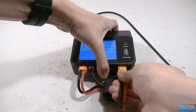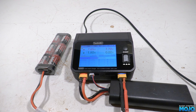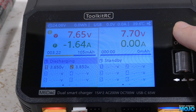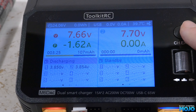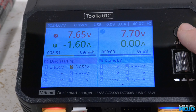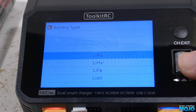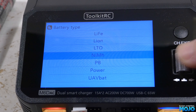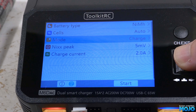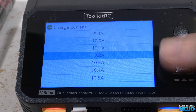While that lipo is running, I'm going to connect up an adapter lead to the second port and top up a six-cell NiMH. It doesn't use the balance port so we just need the main connector. A short press switches the charger channel — it could be clearer on screen; you just get a little one or two in the corner. It would be nice if it was more bold, maybe changing the whole background colour, but it'll do. Then we go into the menu, set up the battery type, set the current — 2C sounds good so we'll set it to six amps — and start it.